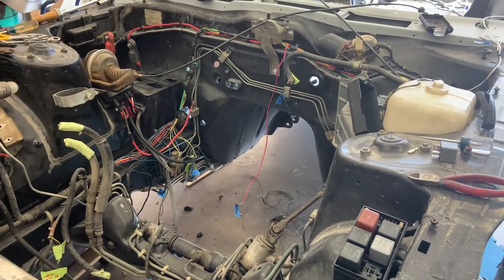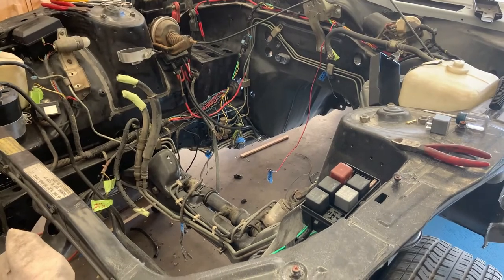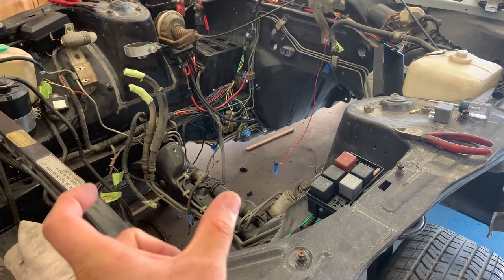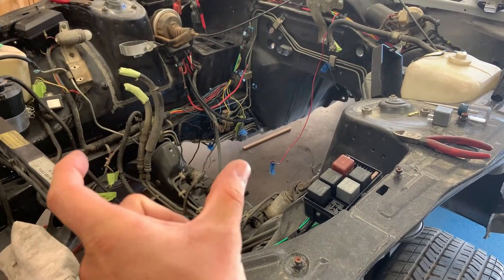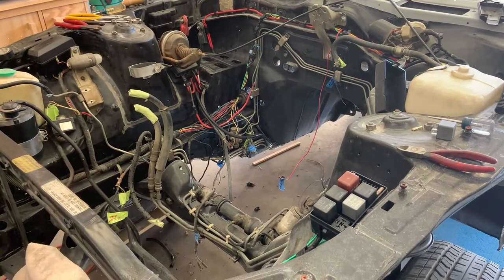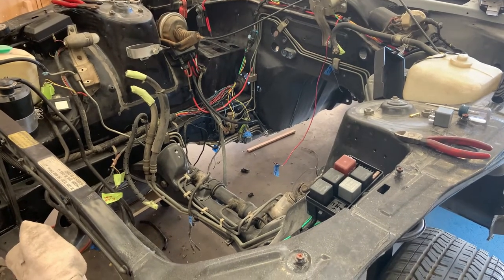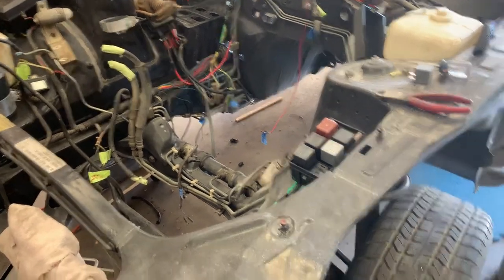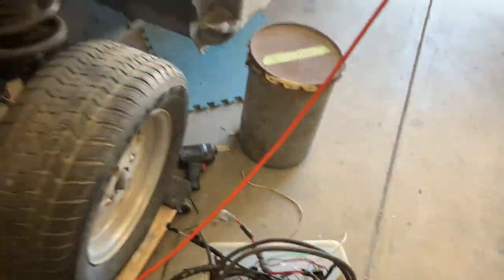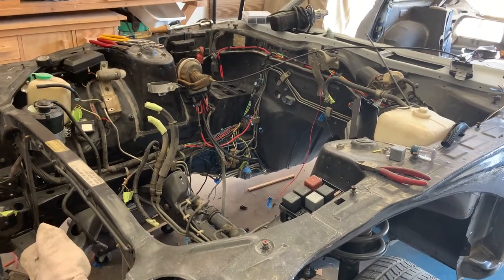Based on the frequency - you set how often you want it to break the ground, which I'll show in the settings - it's pulse width modulation, PWM. You're changing how long it's connected or disconnected, basically changing the width of those steps. That signal gets sent through this little wire to the module, and the module transfers it to an input the electric motor can use, and that's how you get variable speed out of it.